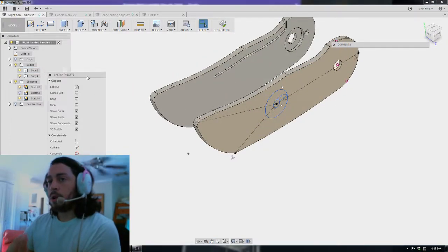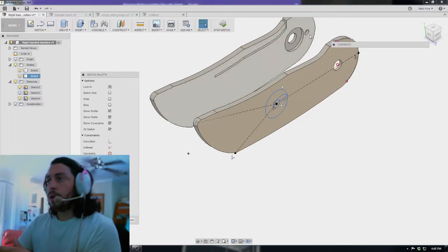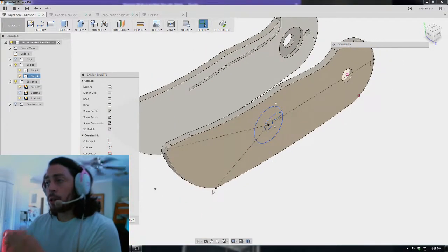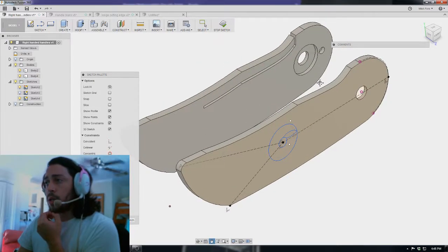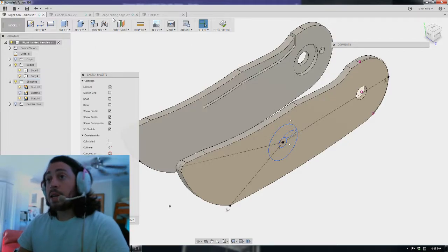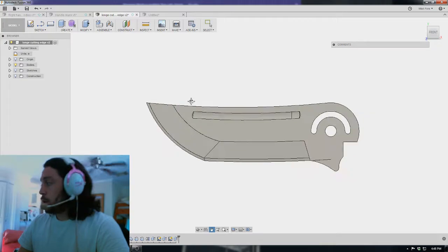It's really easy. You just mirror the same handles across a plane, and it's right-handed again. I have my stop pin. I have everything worked out in terms of distances and locations, except for the detent ball, but I'm going to do that by feel instead of trying to pinpoint it out. But the issue is actually machining it to those tolerances, not exactly designing it. So yeah, I just want to make a quick video about that.